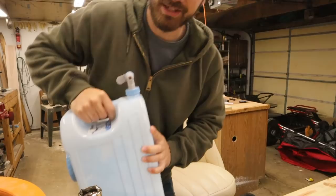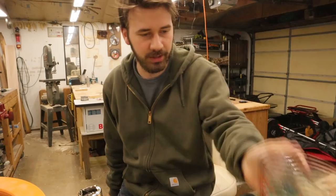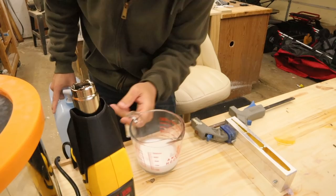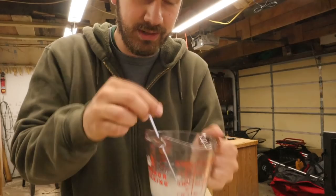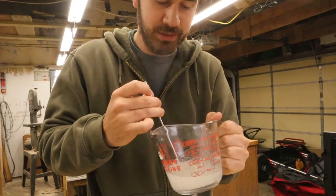Here, I'll just tell you what I'm thinking: a bright white next, then that transitioning into kind of a greenish pearlized mica powder green — very gill-y, very much like a bluegill is what this will look like. It is so easy to waste plastic doing this kind of soft plastic pouring — you can quickly pour over four ounces when all you need is like one. When you're heating up your plastic it goes from that milky white to a gel, then to almost clear. You've got to get it past 350 degrees. This is about 300 degrees right now and it's bubbly because I've been stirring too much, but I don't care because I have a vacuum.